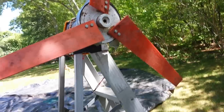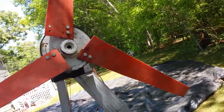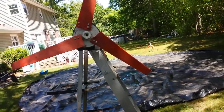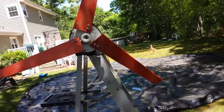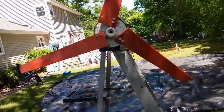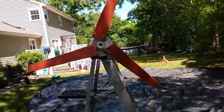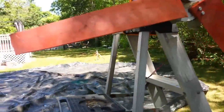This one worked before when it got windy out, but honestly these blades are just too skinny — there's not enough torque, so I'll have to try this again and make them wider. I couldn't really get an airfoil shape, but they're kind of like a ceiling fan blade — just drag-based, which will work fine. They're definitely gonna work.